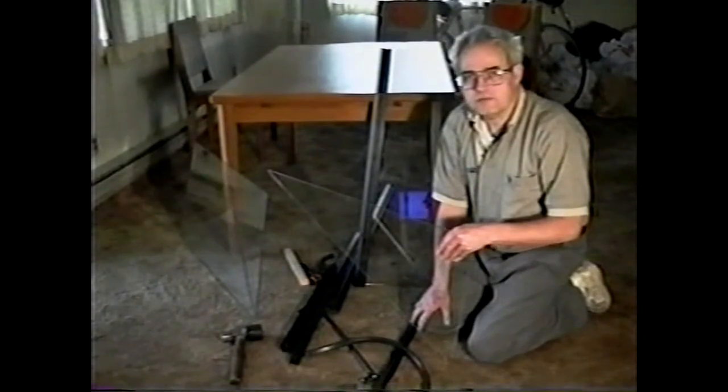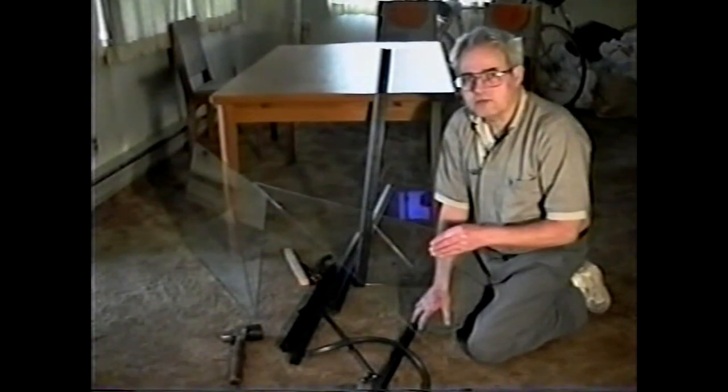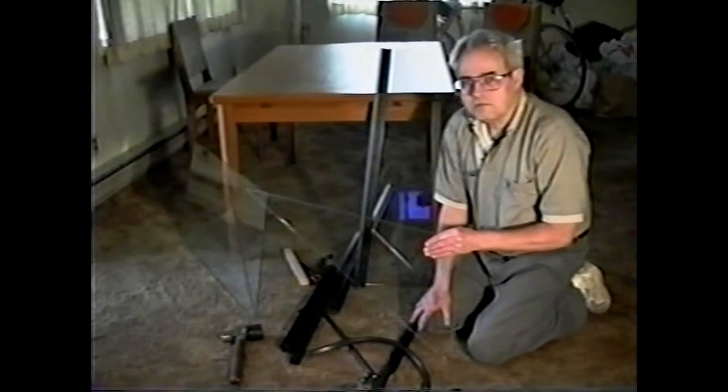However, in the case of the tempered glass, they will usually ship it out and have it done, as it's a specialty item, and generally local glass shops can't handle it because the glass cannot be cut, and it must be heat treated after it's cut.